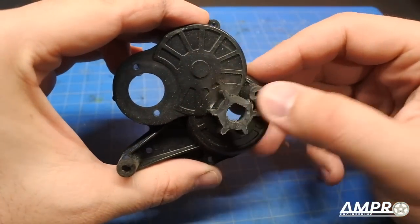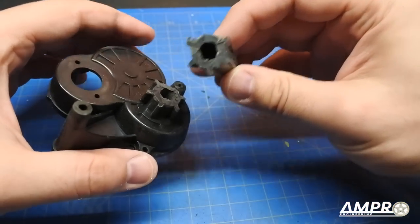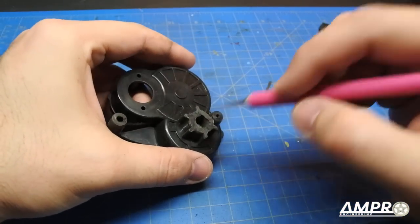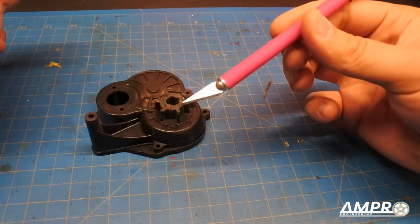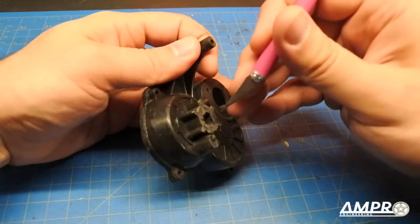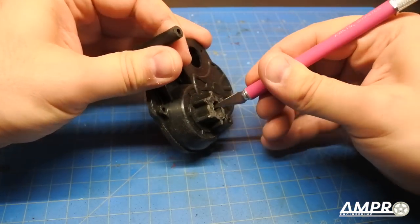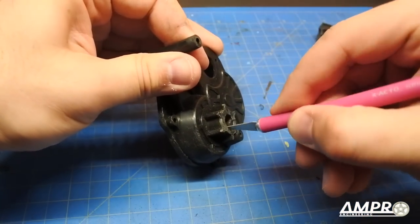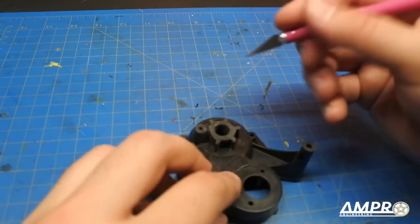With a little patience, you can see I've got the tube cut off — it's a relatively neat cut, the boss is not damaged. Now I want to clean up this area because we are going to fit a sleeve in here and all that flash will get in the way. I've got an Exacto knife — one of the few things more dangerous than a Dremel. Please exercise caution; one of these can go right through your flesh to the bone with minimal force. I'll ride it along the inside wall to clean up and get a nice round hole.